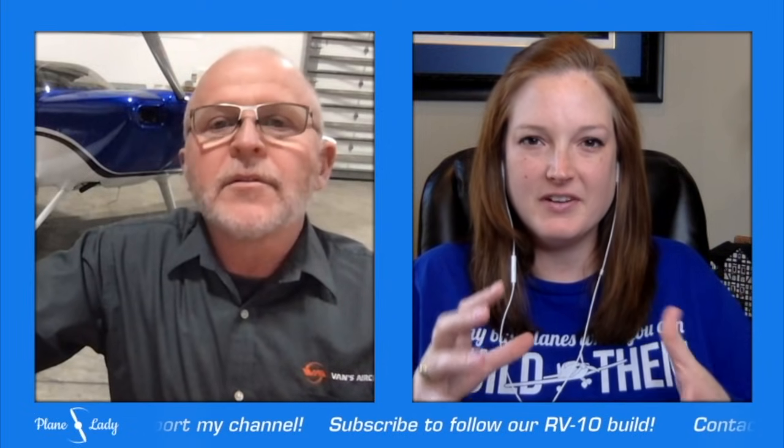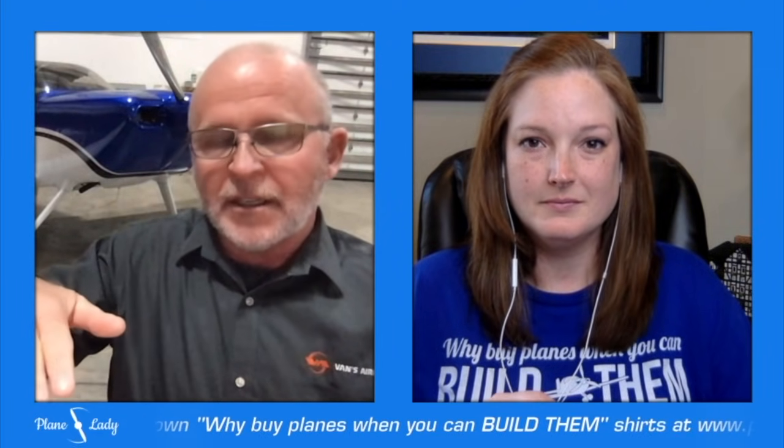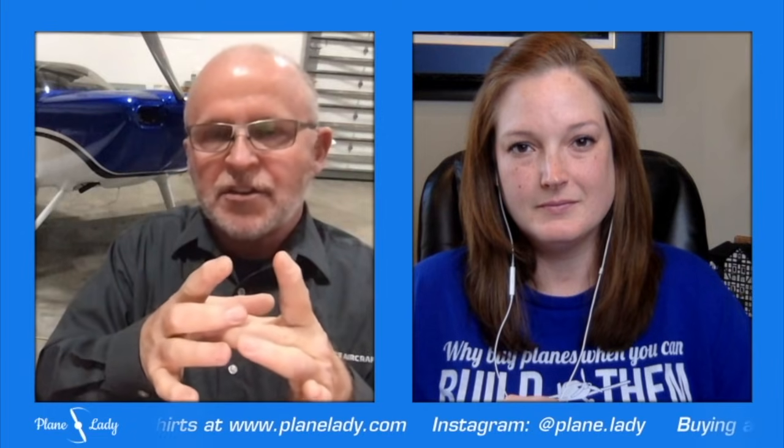The difference is you don't have to take a bit or reamer and run it through the holes to upsize them — that's already done on the new parts. This comes from the new TRUMPF — T-R-U-M-P-F — machinery. TRUMPF is a brand of punch press machinery, and changes to the tooling, the way we sharpen it, the electronic design, and tighter tolerances on these machines allow us to punch holes to final size with even more precision.